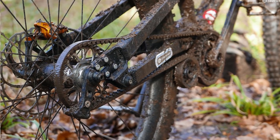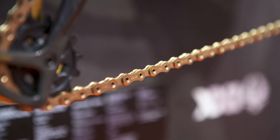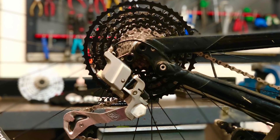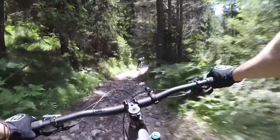To capitalize on that, we've specified a belt drive just to keep maintenance down. In recent years we've seen 10-speed, 11-speed, and now 12-speed drivetrains — we've even seen a 13-speed drivetrain from Rotor. So how about a continuous spread of gears, giving you effectively infinite gearing options? This could take the form of a continuously variable transmission, or CVT, which is used in some cars. That means you could pedal at exactly the same cadence irrespective of the speed you were going. It would also allow you to change gear while pedaling hard, which is not something you can do with a gearbox.